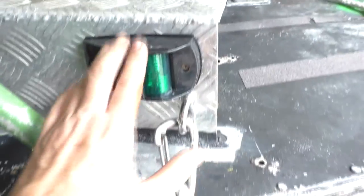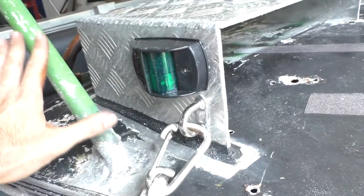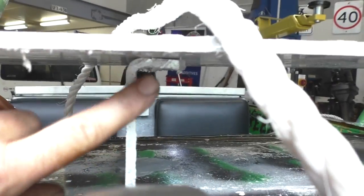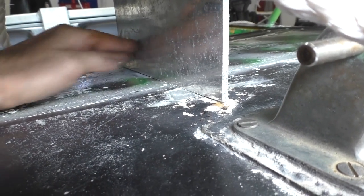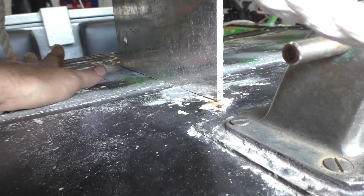So the welds are a bit ugly, but I got the lights moved from their brackets onto the side of the glove box here, and then got some U-bolts here where my mooring lines attach when they're not in use - I'm kind of happy with how neat that turned out. In the middle, hopefully you can see under here, this was a bit of angle which I've riveted through the deck here. I'm going to do a couple of tack welds on the bottom here to stop it moving - it doesn't move at all even when it's unwelded but just to be safe. I'll probably do a bit of Sikaflex here before I paint as well. I'll push on with the welding now and then when we're finished, I'm going to start making the grill for the pump.